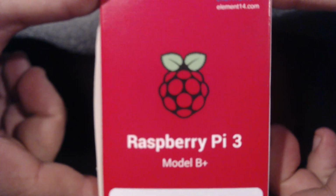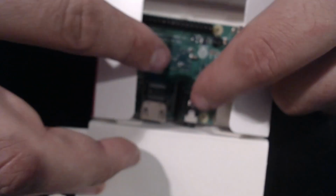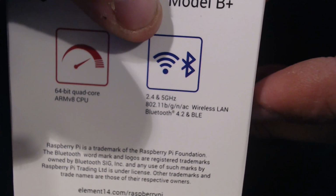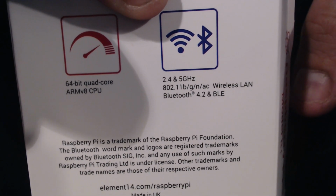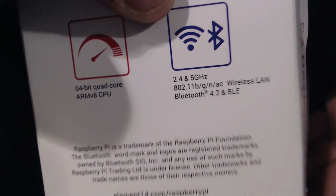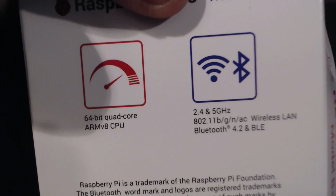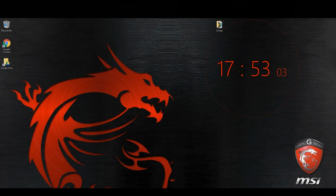You're also going to need a Raspberry Pi. I've got this one here. This is the Raspberry Pi 3 Model B, and that's what it looks like in the box. The reason I chose version 3 is because it has wireless built in. If you use the Raspberry Pi 1 or 2, then you will need to install a wireless dongle or receiver using one of the USB ports. So it's just easier to go with one built in. They're a bit dearer than the other ones, but still very cheap. This one was about £33 from Amazon. Okay, without further ado, let's get started.